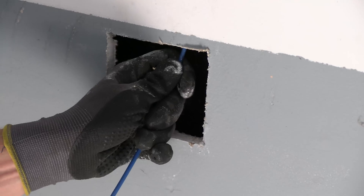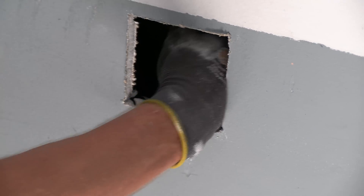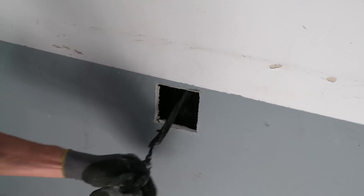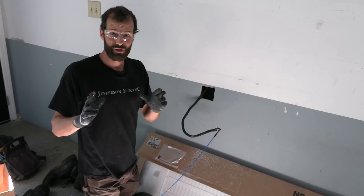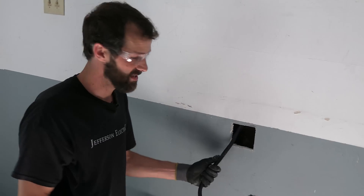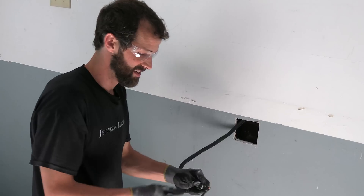Got to pull and feed from above in tandem. Poor Cliff, lying on his belly across the ceiling joists — not comfortable. That's one of the worst things about being an electrician or plumber. I'm leaving a service loop — coming in the bottom of the box with just a little extra in the wall, maybe another eight inches. Article 334 in the National Electrical Code does not require Romex or NM cable to be stapled or secured when it's fished in voids like this, so no staples other than in the attic within every four and a half feet is code compliant. Always check in with your local codes and standards.